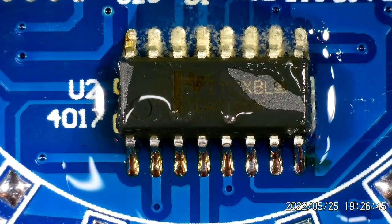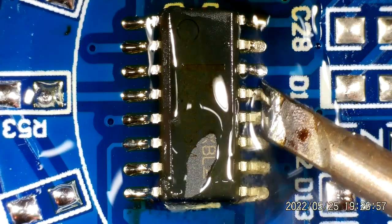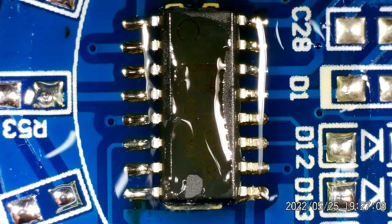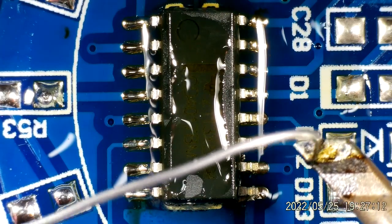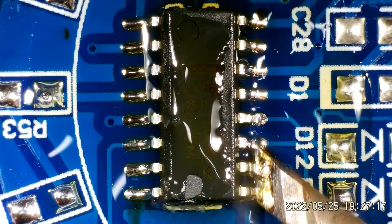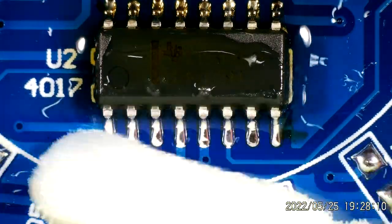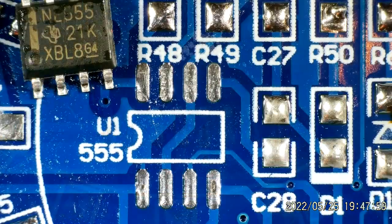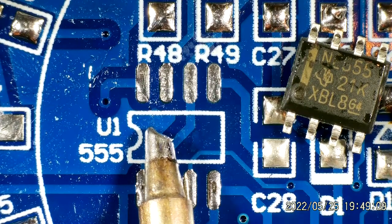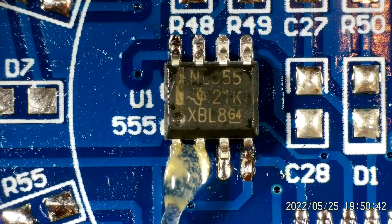Well, that worked like magic — it looks good to me! I think I can reach it most easily this way around. I don't think I've got enough solder there, let me just reload. I'm so proud of myself. I've decided this time to use the chisel tip that I used for the resistors, along with lots of flux.